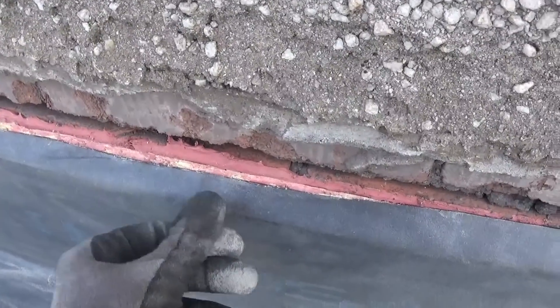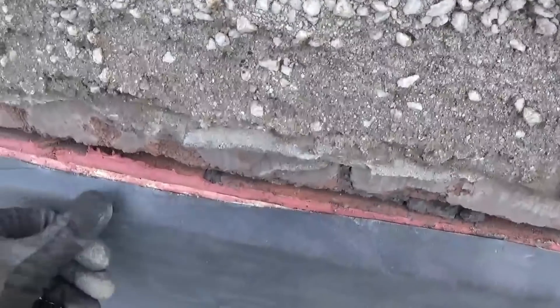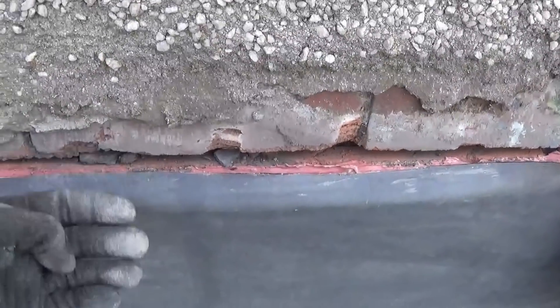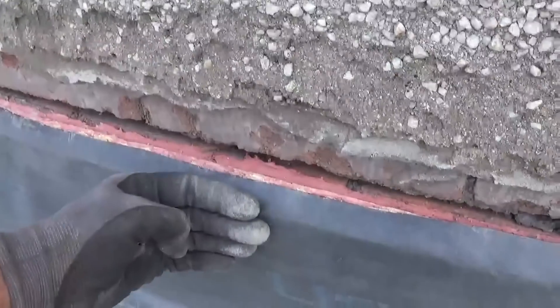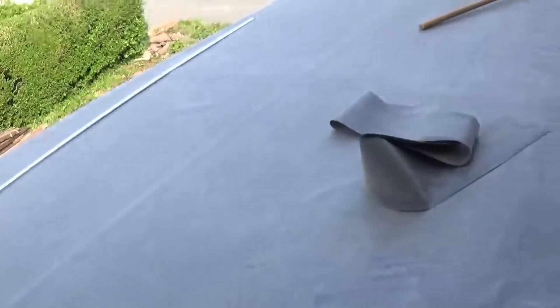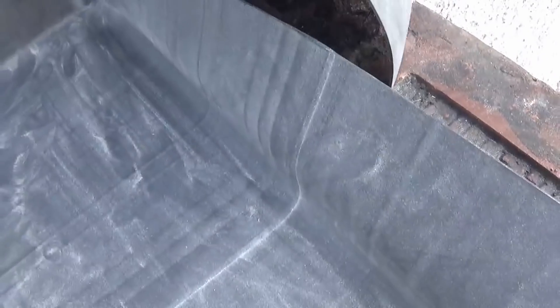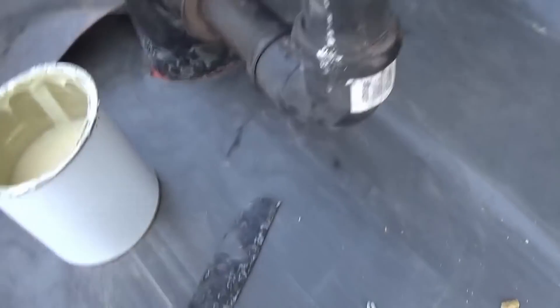We've turned this rubber up bit by bit and applied it to the wall using the contact adhesive. You have to make sure you get in tight here with your fingers first, then roll it up the wall, because this stuff sets really quick - especially in hot weather. Over our tapered edge we've cut the rubber down to size once it was up, stuck it down, and we're going to put the termination bar across here and screw it in tight. I'm going to go over the top with lead flashing out of the groove I put with an angle grinder - that'll make sure we get a good watertight seal and drop any moisture from the top of the wall over the rubber and down the slope into the gutter. Around the soil pipe, we've cut it round in a circle shape, and we'll use contact adhesive to stick it up and cover any cuts in the rubber with the rubber patch material.